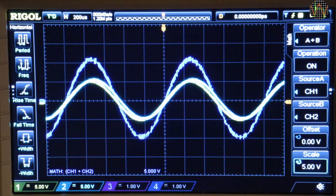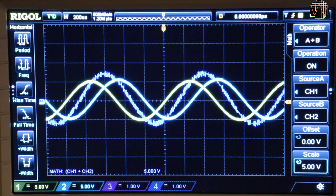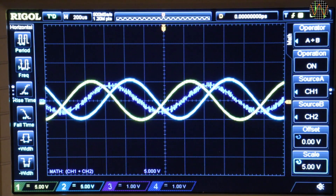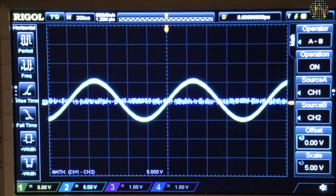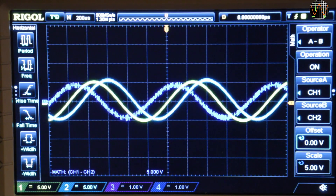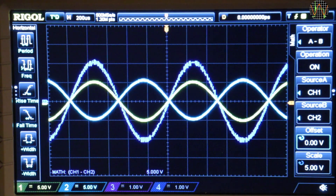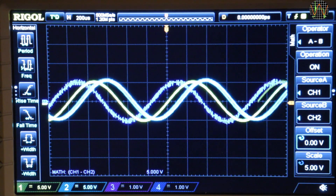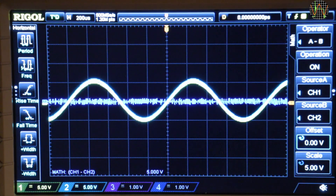The thought occurred to me: what if I feed in two sine signals on left and right and start shifting the phase? Since the transmitter sends left-plus-right for mono, at zero degrees phase shift the mono signal is strong, but at 180 degrees the mono signal should be zero. For the 38 kHz subcarrier the transmitter does left-minus-right, so at zero degrees — identical signals — the left-minus-right should be zero, while at 180 degrees it should be strong. I don't really expect a stereo receiver to be affected, but the mono receiver should be screwed. This would be a neat way to instantly test if a radio is mono or stereo regardless of the number of speakers.